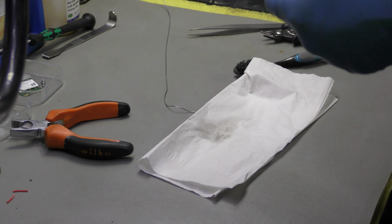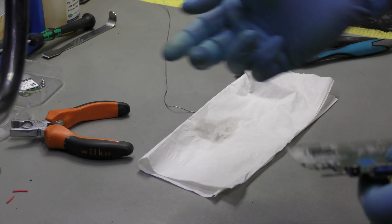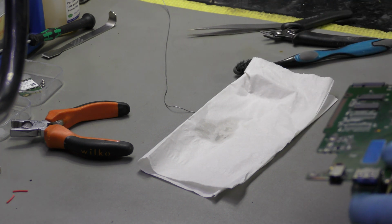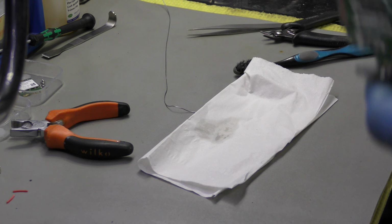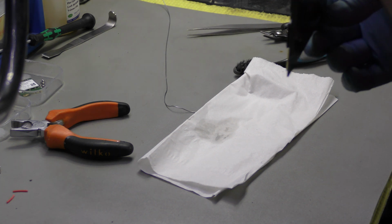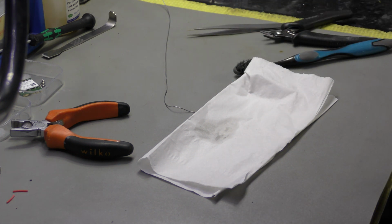Whatever the model this jack is, I can't fully recall. As I said, the 100 series jack is not the same. Even if there is one, it's not anchored like this, and it's not long, it's always short, like an L shape. You're going to be struggling, you will have to run a jumper wire to get this board up and running, the Ultrabook working again. Absolutely no chance. So I'm just inspecting to make sure that it's laying flat and not crooked, checking the solder joints at the bottom.